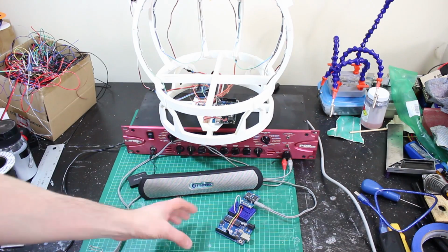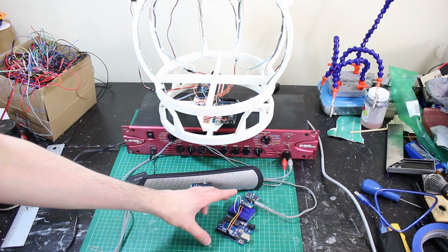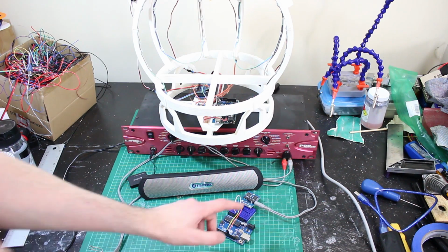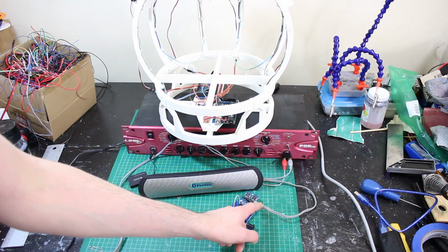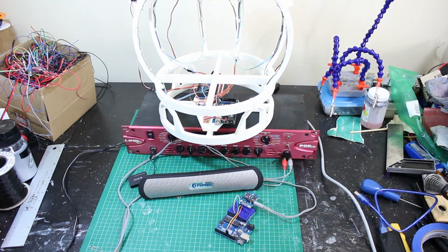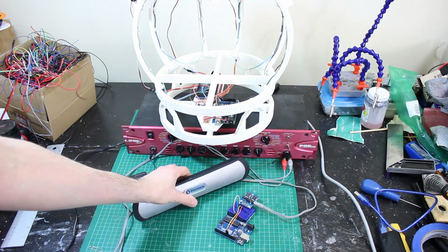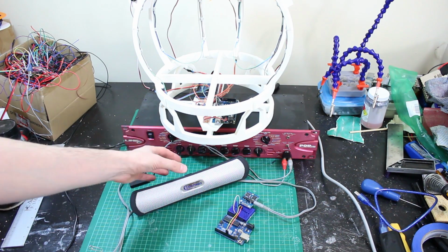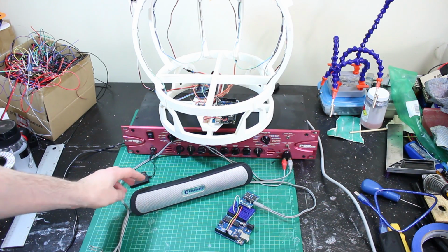So our choices are reading the text for each sentence and syncing up jaw motions and sending that jaw data over Bluetooth to the robot like the other axis. Or we could read the analog audio out of this speech synth and then try and sync up to that, we're looking for peaks and so on, and send that data over Bluetooth. What we're actually going to do is read the audio at the Bluetooth speaker end and stick that straight into the jaw. So we're again going to read an analog in from the inside of this speaker, and that way I can make it very fast.